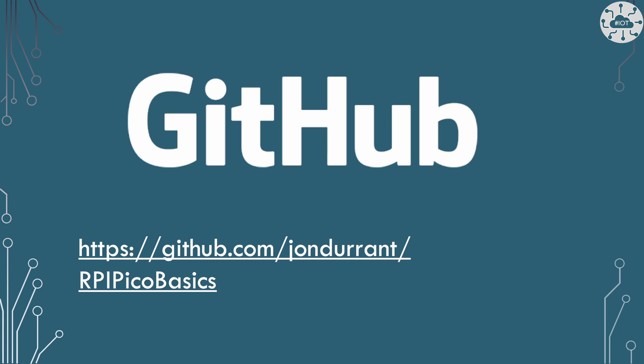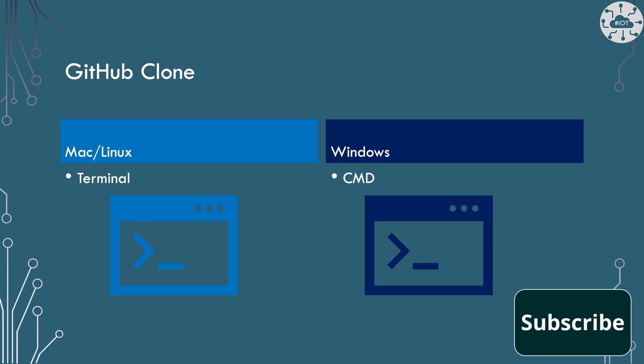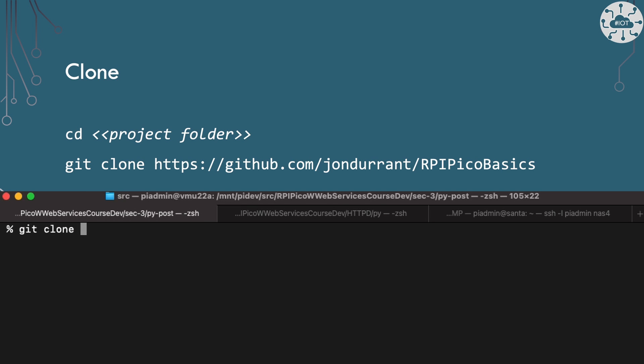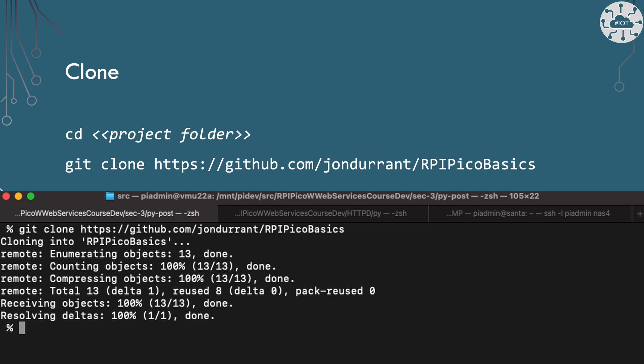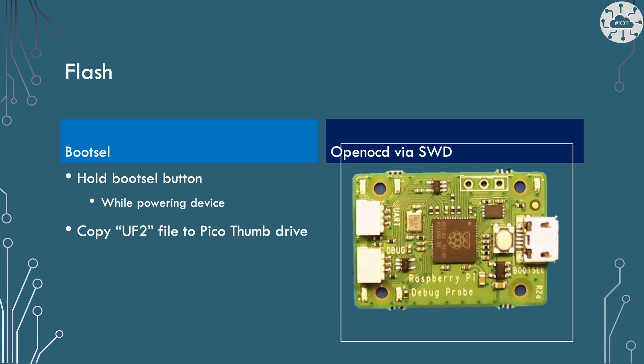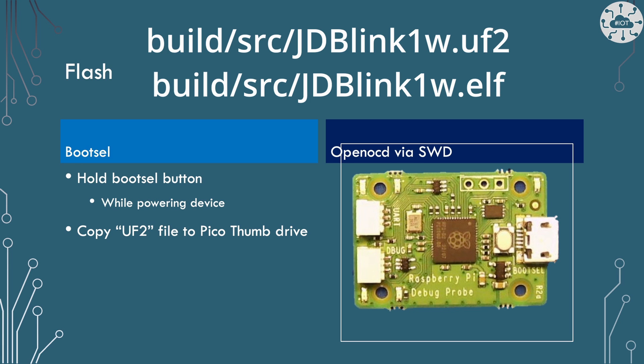All the code is included in GitHub and I'll put a link in the video description so you can easily find it. You can clone the repository on Mac, Linux or Windows — it's very easy, you can just use this command line. The description for that is actually in the repo projects. Today's example is for the Pico W and to flash the LED, so I've put that in the folder two-Pico-W-flash. You can build a project using the Pico SDK just by going through these steps, which is slightly different if you're on Mac or on Windows.